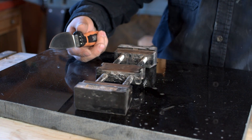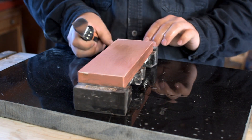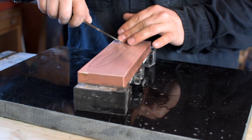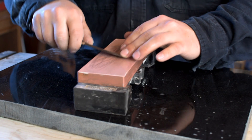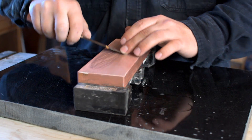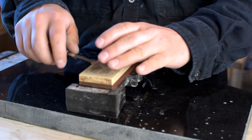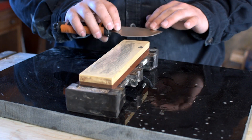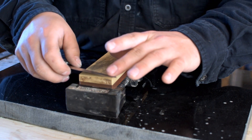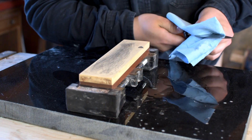Super light pressure here now. I'll go over to my 3000 grit, and then come back when I am finishing up with my 6000. I will do the necessary steps on the 3000 — the exact same as you saw already — then move over to my 6000. Just drew through my piece of wood ever so slightly, doing a few cutting strokes, super light, extra light, just to create that perfect rock solid edge. No burr, no wires grabbing. Clean off that little bit of residue.